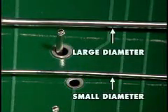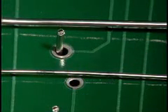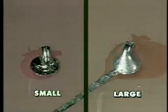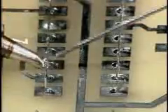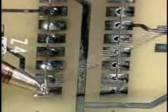One variable that affects the feed rate is the solder diameter. Of course, a larger diameter will feed solder into the connection quicker. Many operators use what is referred to as a pulse feed. With a pulse feed, quantities of cored solder are pulsed into the connection at regular intervals to maintain a fresh supply of flux.